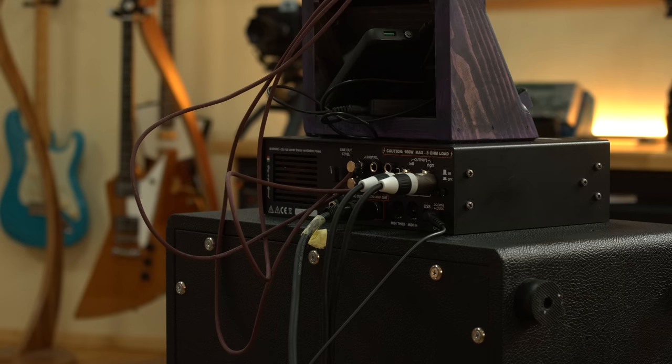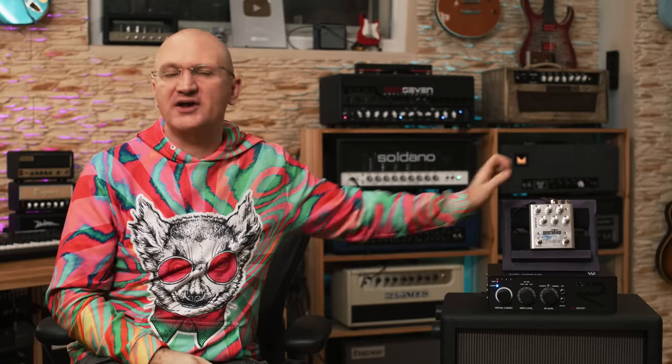So if you're putting this in a live rig and you want your rack stuff, either your rack effects or whatever pedals you have, wired into it behind your amp, which is very cool. So that means you can actually have effects behind your really cranked Plexi or JTM or any kind of vintagey amp that doesn't have an effects loop. And I'm going to show you, I have some of these. And then put it all together in here and run that XLR to the front of house. Because if I now wire this in, what I have is quarter inch, and then I need adapters. It's just a convenience to have the effects loop in there.